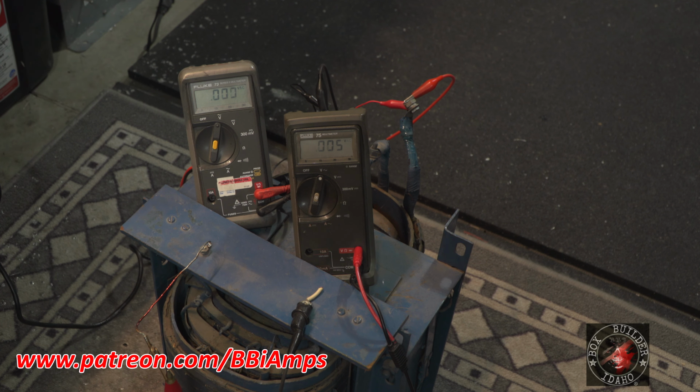So let's go ahead and ramp this up. Remember, we're only putting 110 volts, or 120 volts, on the input. I've got 120 coming out of the wall here. So, let's see what happens. Here's 10 volts. 10 volts in is 400 volts out. Well, that's going to put us around 4,000 volts, I think. Here's 24 volts, 800 volts, 900 volts. There's 30-something volts in, and over 1,000 volts out. 50 volts in, almost 2,000 out. Well, the transformer's not humming, nor is it smoking. That's a good sign.